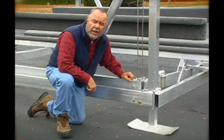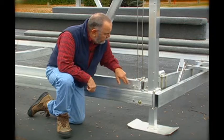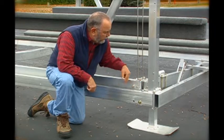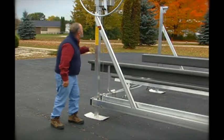Great Lakes Lift uses stainless steel cables, Nylatron GSM blue pulleys, stainless axle shaft with grease fittings and rollers in the corners. Our cradle has a full 63 inches of rise.